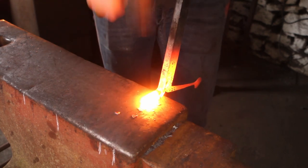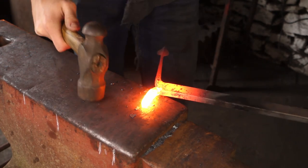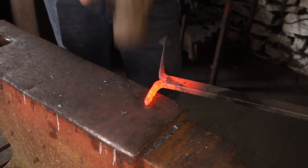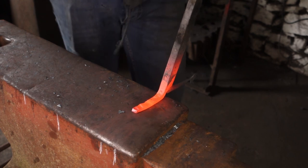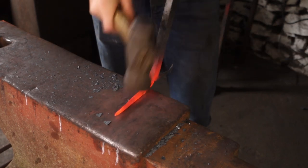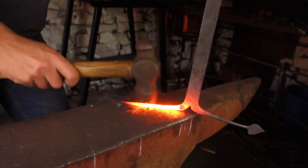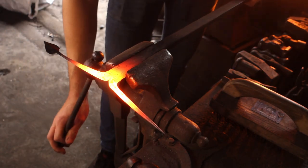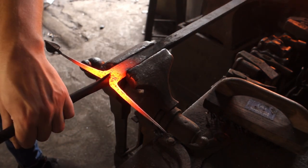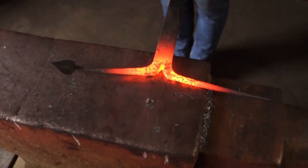Drawing the material down for the root — what we can do is angle the hammer over and really nip the material out by reducing that surface area contact using the edge of the hammer. We can now work this to octagon and then to round, just like the other piece. Just to refine the transition between the bar and the two split pieces, we'll come in and work this area with a chisel. And if we go back to the anvil, I can run that line down the bar a little bit.